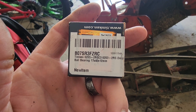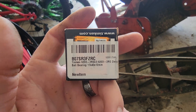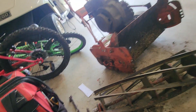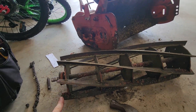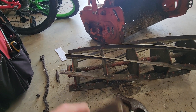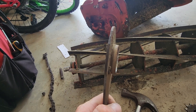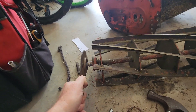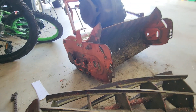It's a ball bearing, 17 by 40 by 12 millimeter, and I've already tested one — fits perfect. Now just gotta put it all together. Make sure when you're putting it back together that the beveled side goes towards the reel. I hope this helps!